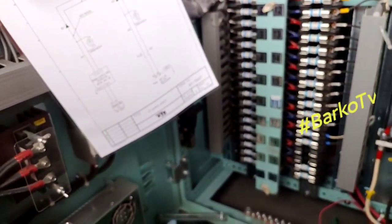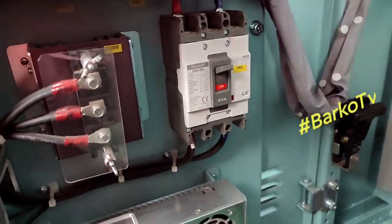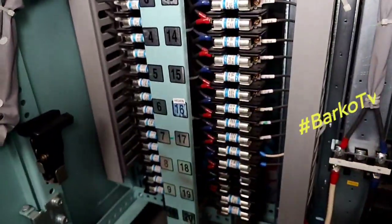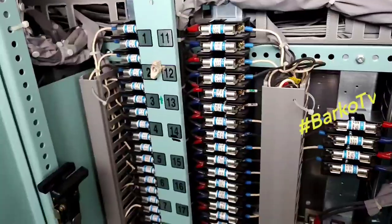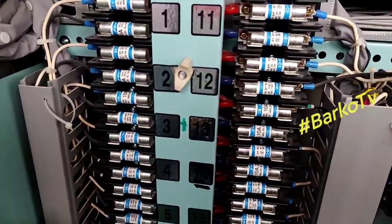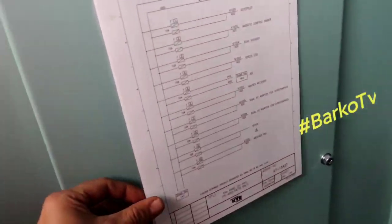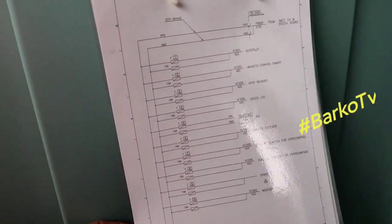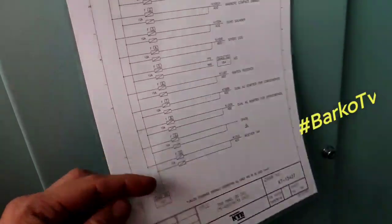If you have a low insulation alarm for this section, this is the isolation breaker for the bridge console 24-volt supply. This is the NID panel — emergency navigation instrument devices — also 24 volts. It supplies the autopilot, magnetic compass dimmer, echo sounder, speed log, and navtex.